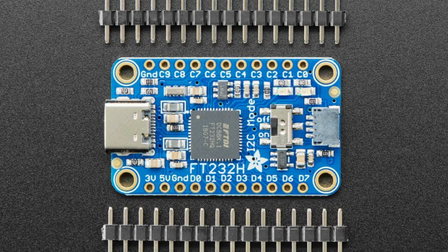We have a breakout board for the FT232H — we recently revised it. It's got I2C, SPI, 16 total GPIO pins, JTAG, and 8-bit parallel. We updated it to add a USB-C port. But I want to note that this board — the H, not the HP — only has two 5K resistors on the CC lines to tell the host device this is a 5-volt USB device. It doesn't do any power delivery negotiation, which requires a separate microcontroller and is quite complicated. So you would not be able to use this board to get more than 5 volts out of USB-C.